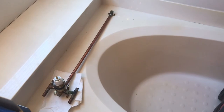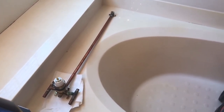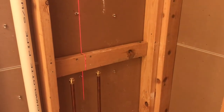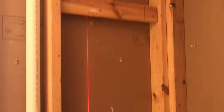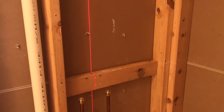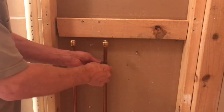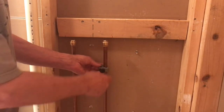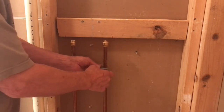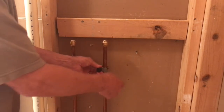Here's the old shower valve and shower head riser that I'm going to be rebuilding. I had already cut it off from the supply line, so it was just a matter of unscrewing the brackets from the rough-in framing. Here I'm using my laser level to ensure vertical plumb — it's probably a little bit overkill; you could just use measurements from your side studs. I've shut the water valves off down in the basement, opened a couple of faucets — one upstairs, one downstairs — to drain the lines, and I'm cutting these supply lines down a little bit lower to make it more convenient for putting the new assembly on with the couplings.